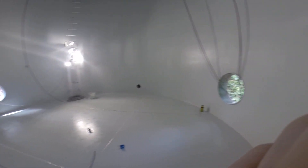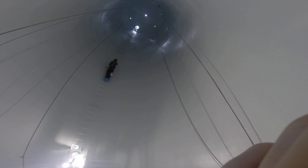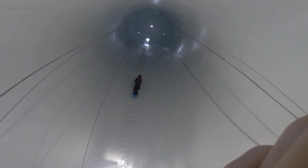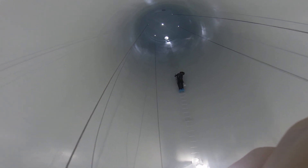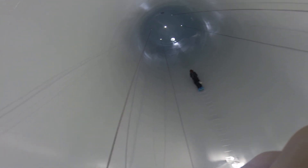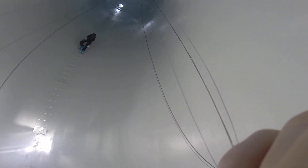This is N140 as far as our top coat. Hydro Zinc for primer — we used 94 Hydro Zinc, N140 primer, stripe coat, intermediate coat, and top coat. And the inside of this tank came out beautiful.